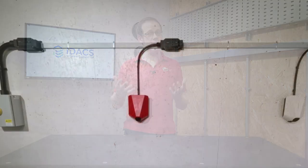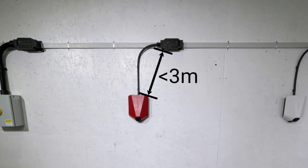However, we do still need to meet one of the two indents, and these are really addressing the issue of fault current — what's going to protect the cable if two conductors touch each other, or live touches earth? Well, we can apply indent two in this case because the length of the drop to the charging point is less than three metres. But what about the rest of that regulation? If you can install the cable so the risk of fault, fire, or danger to a person is reduced to a minimum, then you can still have the protective device along the smaller conductor instead of at the beginning.